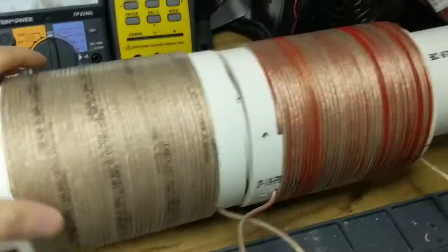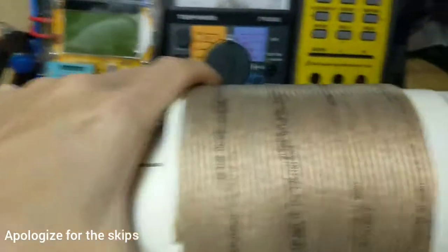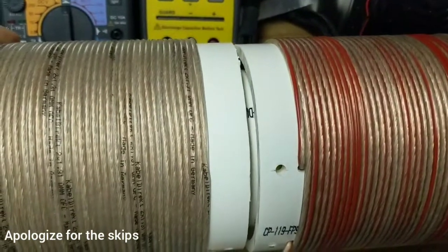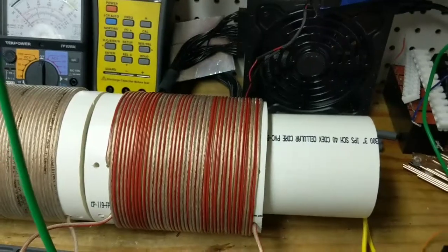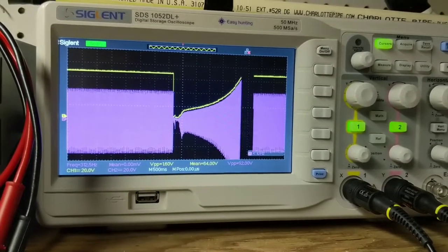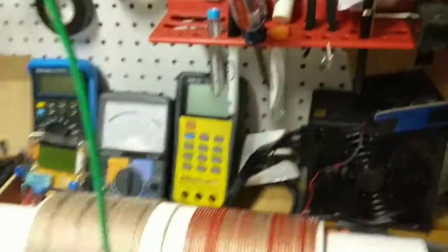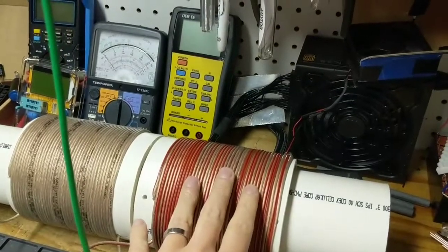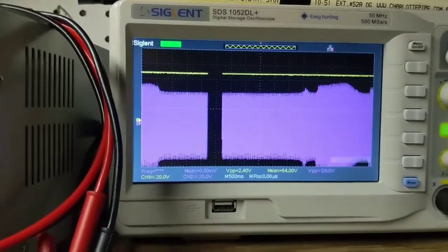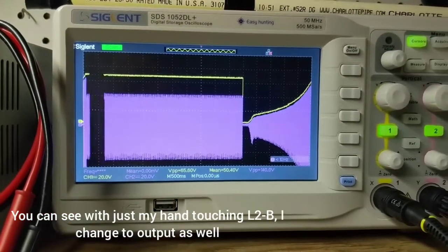Now I've basically moved my L1 completely inside L2B — it's kind of hard to see through the crack. But look at what's happening. I've had to increase the L1 frequency quite a bit to 2.3 megahertz. And if I short out, we're not seeing that stepped-up configuration, but we're back to a normal trumpet wave. And we have a very high coupling between L1 and L2B, which probably also contributes to the very high final voltage that we get to.